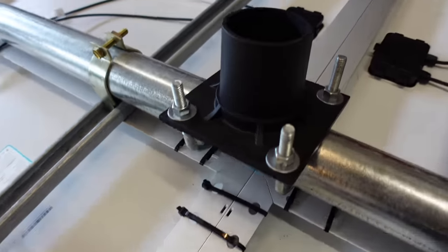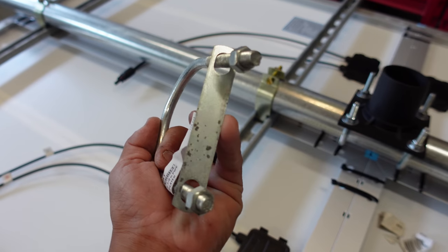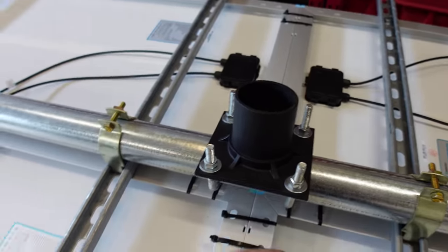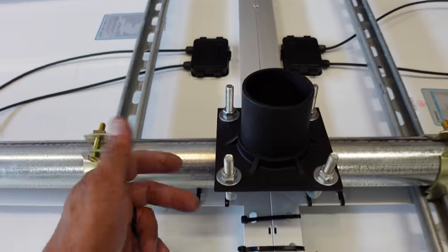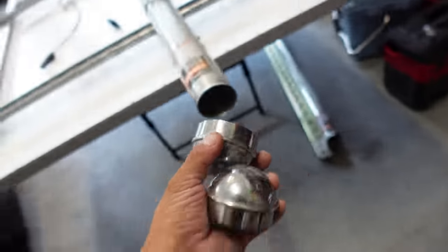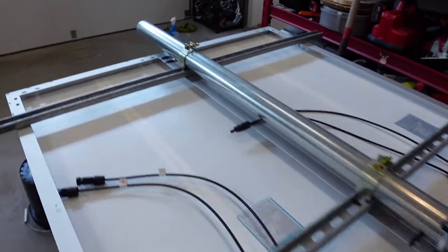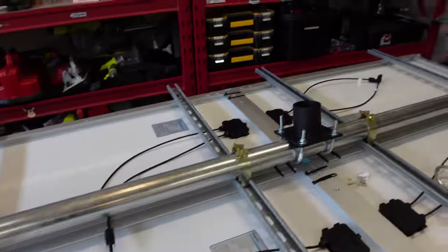Here is the top of the mount that sits on the post in the ground. These are two-and-a-half-inch pipe U-bolts. The bridge acts as a washer but you actually have to pry it apart just a little bit so it fits in the holes since it's slightly bigger than two-and-a-half inches center to center. I ended up putting a nut and washer on each screw, so that works perfectly. Now I just put the end caps on to dress up the ends — that way bees can't make nests inside, because they'll be in there in no time if you don't do this.